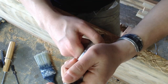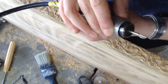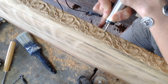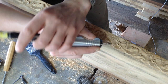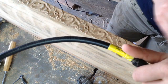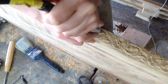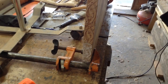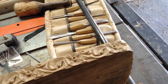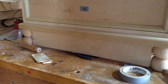I edited some of this out because otherwise it would be ridiculously long — it's just a matter of going through each part and checking again. The last bit I use is essentially for sanding — one of those diamond bits. It's great for wood; it smooths everything out and leaves a really nice finish. Instead of sandpaper, this is what I use. When the carving is about 90 to 95% done is when I switch to this bit because it still removes material but also cleans up all the edges. The depth isn't as apparent on camera as in person, but I wanted this relief carving to look as three-dimensional as possible. That design wrapped around the entire edge over the top part of the dresser. The end grain just took longer, but it wasn't extremely difficult.